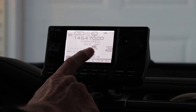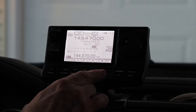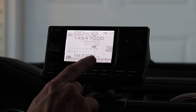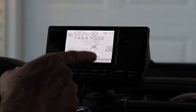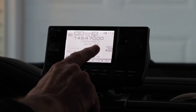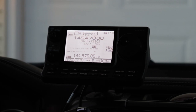That WX indicator means the radio is scanning the weather channel. One important thing: when turning the weather alert on, you need to make sure you have it tuned to a weather transmitter where you're actually receiving a signal. So the first thing you do is go to the weather channel mode, select a station you're receiving with good signal strength in your area, then go and turn on the weather alert. The weather alert operates just like a standalone weather radio — the 7100 looks for specific alert tones that the National Weather Service transmits when there's a watch, warning, or any other weather alert in your area.